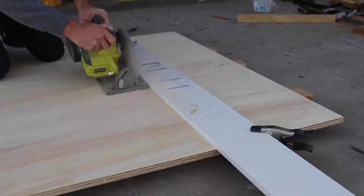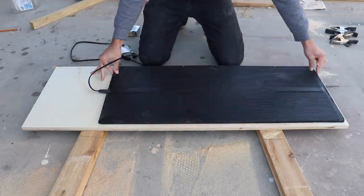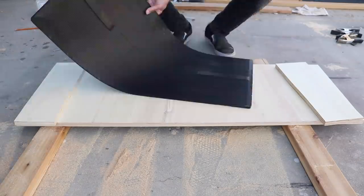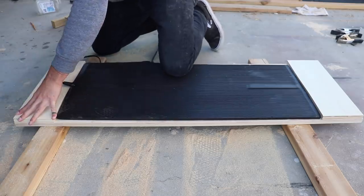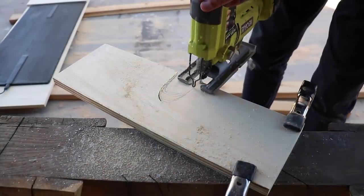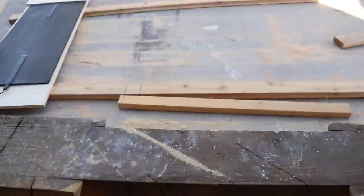I'm going to cut some plywood that I'm going to use on the underside of the bench. This is going to give me material to attach the heating mat to and it will also give me a place to fasten the steel legs to. I cut plywood that was the same width as the heating mat but a little bit longer, then cut two additional pieces of plywood that would go on either end. I drill a hole for the cord to come out the bottom and then cut it a little bit bigger with my jigsaw.